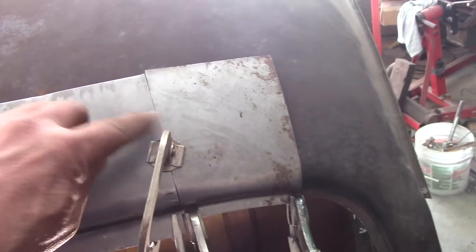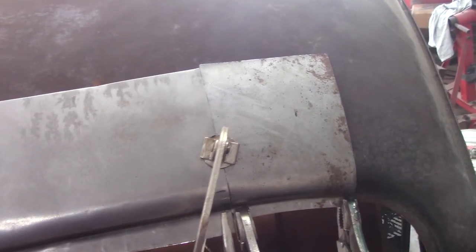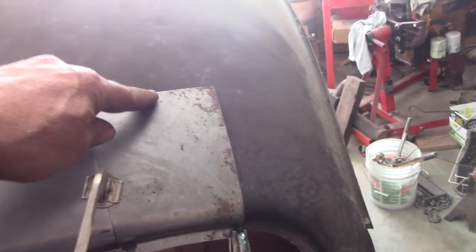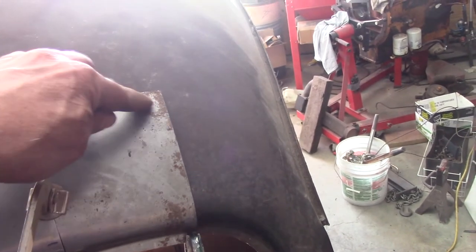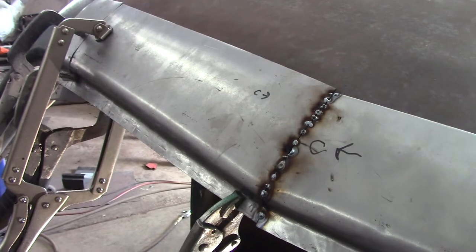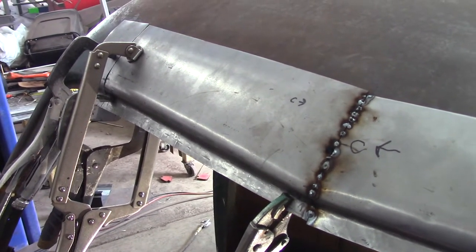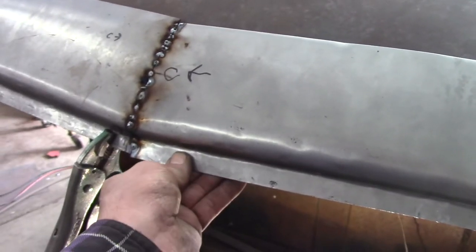So I'll have to push that down a little bit and put a little tack there. I'll put a couple tacks, then I'll be able to take it off and work on it to get it so it looks like one nice piece. I gotta even that up because I don't want to have to make any notchy cuts. I'll probably just keep it square and slowly tack it in place. But I gotta put the inner piece in first before I can weld this piece on. It's a puzzle and there's no quick way. I would wild-guess I have 10-12 hours in doing this — just fabricating these pieces and putting it together. And I'm maybe halfway done? But that's what it takes. You can't rush it.